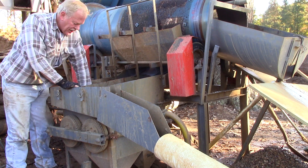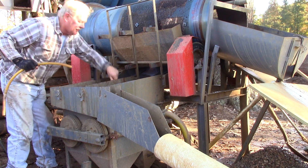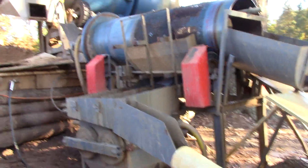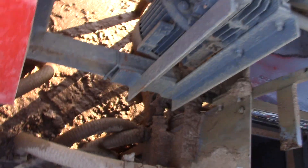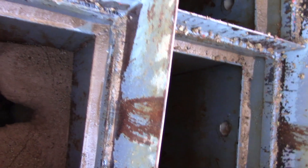There's a whole set of valves over here and it looks complicated but it's really pretty simple. An inch-and-a-quarter pipe comes in and feeds all of this manifold with all these valves. The first valve on the left feeds the spray bar to the scrubber trommel. The next one I don't have open when I'm running it — only when I clean it. When I want to wash that out, I'll open that valve and flush this out, get all the mud and sand out the bottom here.